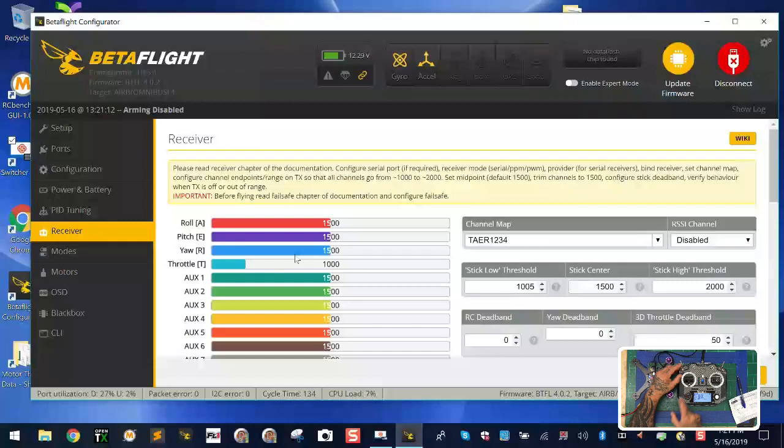Now I'm done with the mixer. Press page again to go to modes in Betaflight. Click add range and flip the switch you want — it automatically assigns auxiliary 1. I use a three-way switch: farthest away from me is disarmed, middle is armed, closest to me is also armed. Drag the tab all the way to the end and click save. This tells the flight controller that whenever the switch is in middle or third position, the quad should be armed. The reason I do this is if I accidentally bump it during flight from third to middle, the quad is still armed — added safety.